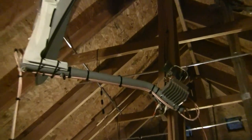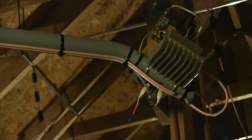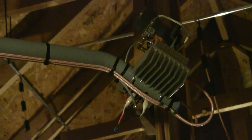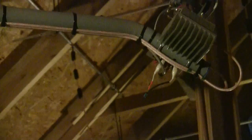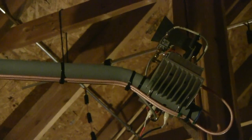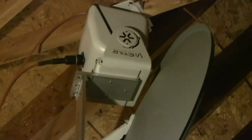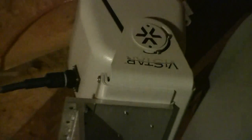And lastly, a little bit better look at the 10 GHz dish. That boom arm that comes out was longer — it had attached to it a commercial VSAT transceiver unit. I shortened it and made my own mount for my horn feed. I also fashioned the bracket that you can see up here for the pan-tilt unit to be used for azimuth/elevation control.